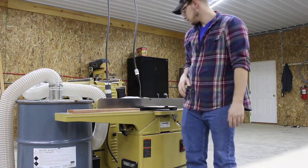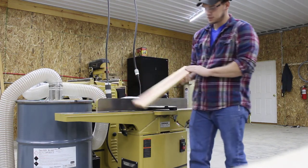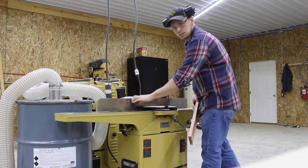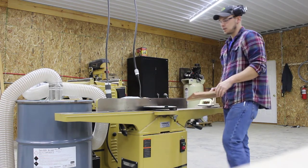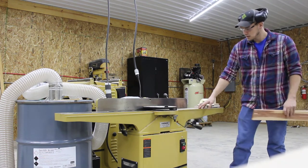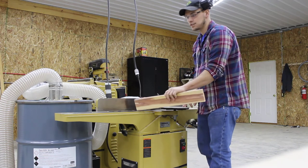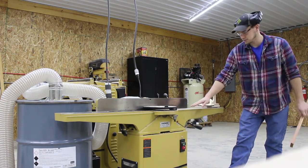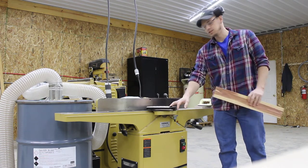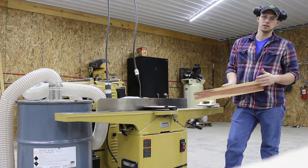So we've gone across there and you can see we've taken every bit of rock out of it. We've got a nice smooth face. When I come across, I was keeping most of my pressure on the outfeed table. The reason is your outfeed table is what's going to make your board flat. Your infeed table is set about a sixteenth of an inch below your outfeed. Your cutter head is set at the exact same plane as your outfeed table. So however deep you've got your infeed table is how much material you're taking off the board. I took a sixteenth off and got a nice flat smooth surface. Sometimes you'll have to take multiple passes if your board is really twisted.